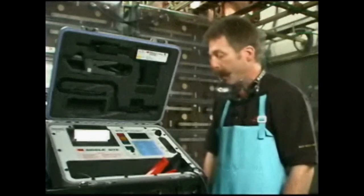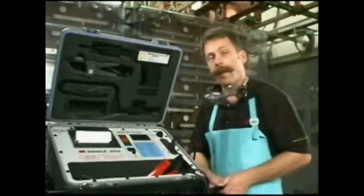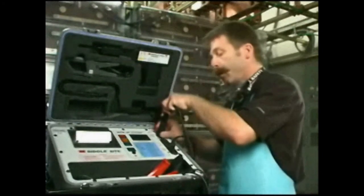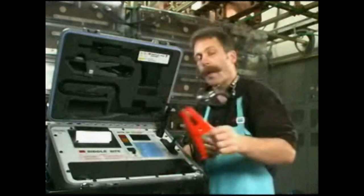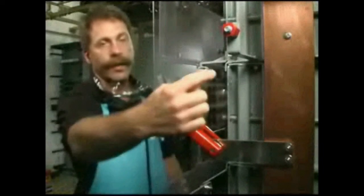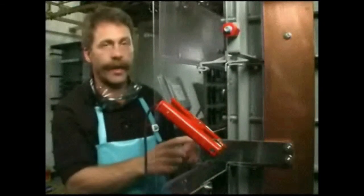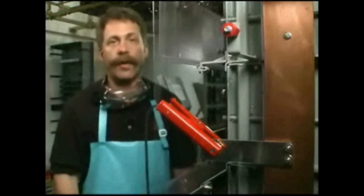The connections we make will be the 110 power connection to the input module, and the current source leads which are keyed, which actually apply the current to the battery. We take the red lead and apply that to the positive bus. We're going to make our connections to the positive bus bar outside the cell — you can see the copper bus bar with the connection to it, and this red lead is outside the cell. That way we get proper current density when taking the measurements for the impedance.